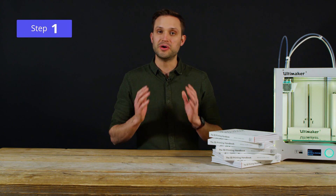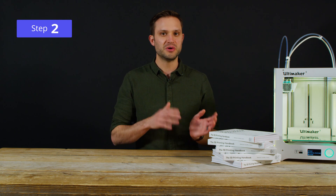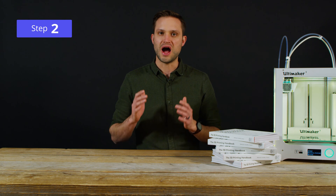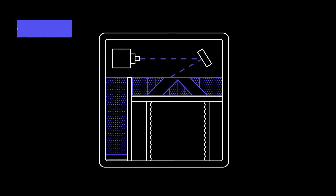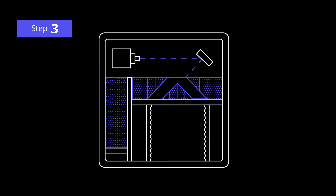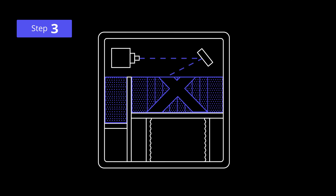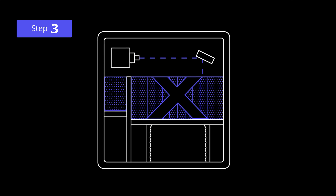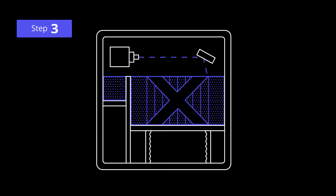So what are the key steps that a metal printer follows to produce parts? Firstly, the build chamber is filled up with an inert gas. After this, the build chamber and the powder are preheated to an optimal printing temperature. A thin layer of metal powder is then spread over the build platform and a high power laser scans the cross section of the component, melting or fusing the metal particles together and creating the first layer of the 3D printed part.